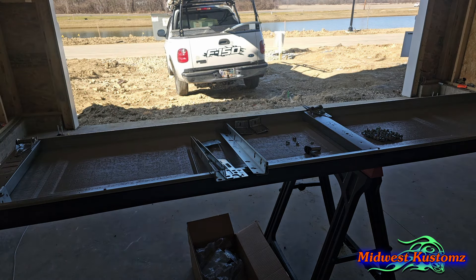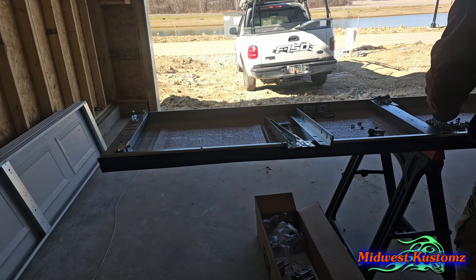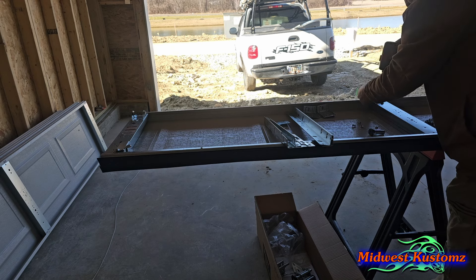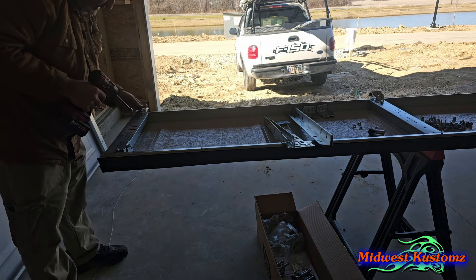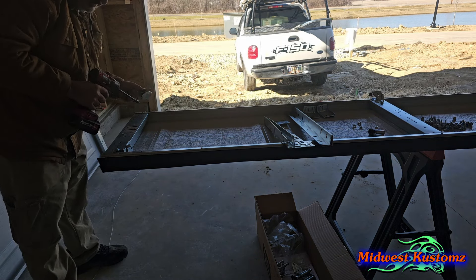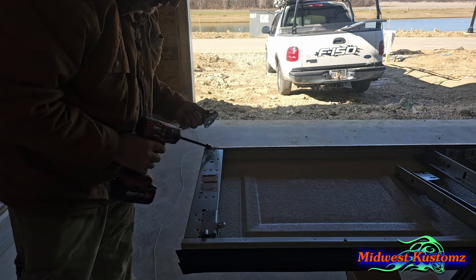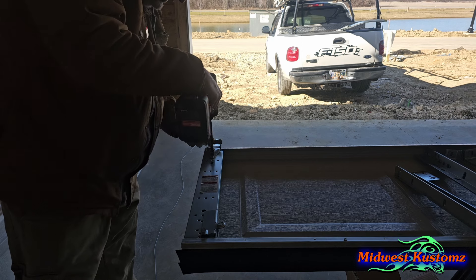I go through and put all these on with the number down, bottom bolt hole, then tighten them up — same thing all the way down the panel. On the end brackets there are a bunch of holes along the top. Starting from the top hole, put your bracket on there and take it down. Use your top hole for the slot because the bracket covers half of the second hole and you'll just be fighting it.